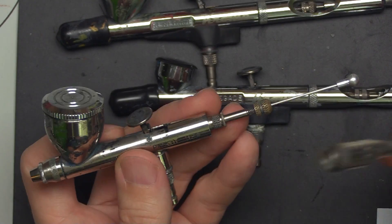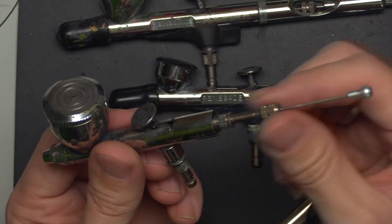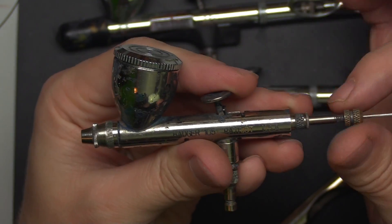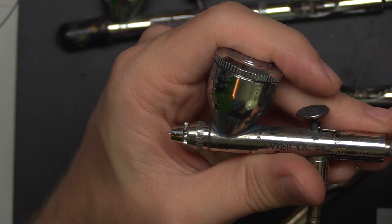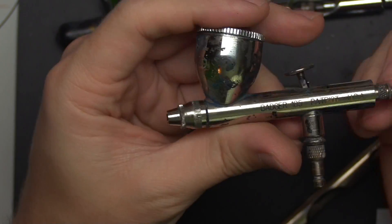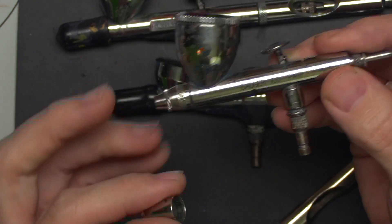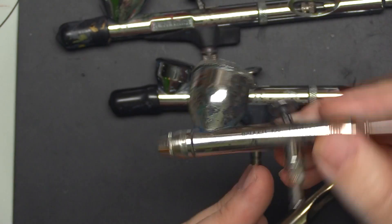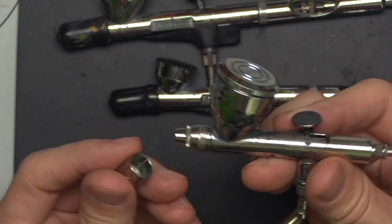Second big thing: this back cap does come off but I always keep it on to protect the needle so I don't bend it. If this gets bent it's not the end of the world — the front is more important — but I keep it on because I like the weight and it makes it less front-heavy for me. Some people like to take it off. So you've got the needle chuck here, and we're going to loosen this — that allows our needle to move. Needle forward, needle back. I always store it with the needle pulled back ever so slightly — no needle showing — then tighten that down. Now no matter what happens, no matter if this cap goes flying, your needle is protected. If the needle gets bent you can try and fix it, but your spray won't be even, you'll get spattering, your spray will be off to the side. So I highly recommend cleaning when you're done, then pull your needle back and tighten the chuck so it's always protected, whether you have a cap or not.